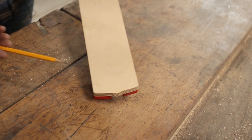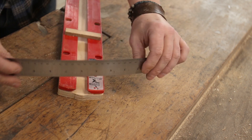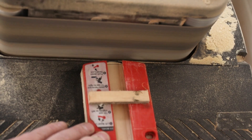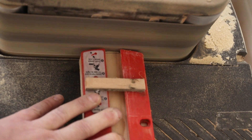Since this is a two-piece plate, we don't have anything to reference the bit on between the two sides on the ends. To get rid of that little nub I used a flexible ruler to mark the radius — or you can just freehand it — then take it to the sander and slowly remove it until it's all even.